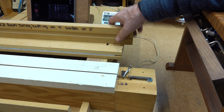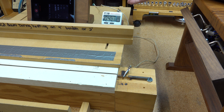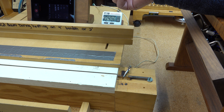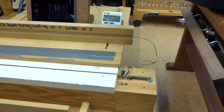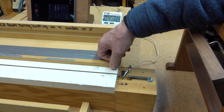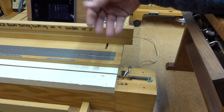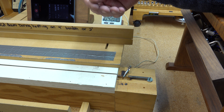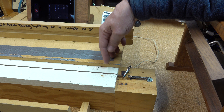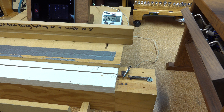If you're doing repeated bends and need to mark your plastic, be aware that even a pencil mark tends to burn in from the heat and becomes hard to remove. What I started doing instead is tiny scribe lines, because those don't show up later.